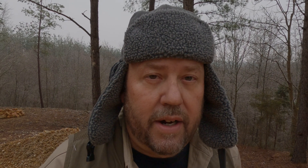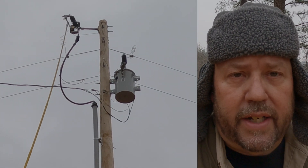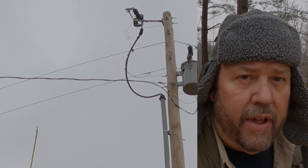Now as a landowner, if you have a deep property, you may also need to transmit power over long distances or provide a lot of power. So you can actually extend those primary wires that go down the road into your property. That's exactly what we're doing here — we're going to take that 14,400 volts, connect right up to it, run it down the length of our property, and then tap into it with transformers where we need service. So we kind of have our own little electric company grid — well, not really a grid, because if one part goes out they all go out, like Christmas lights.